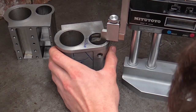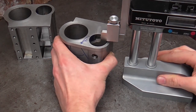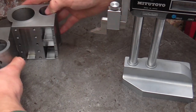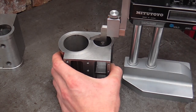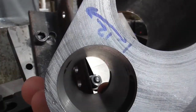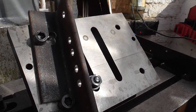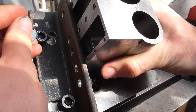Just before I start, I've decided to scribe on a cross for the start and finish positions of each passage, so that when I get on the machine I can do a final check and make sure the passage is going to appear where I'm expecting it to. I've scribed a crosshair on the top and underneath, and that should mark out the centre line of the slot from top to bottom.